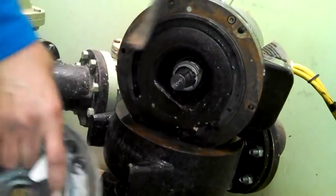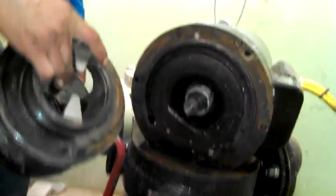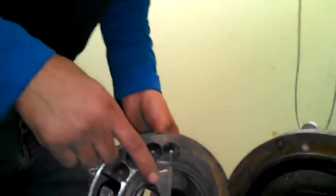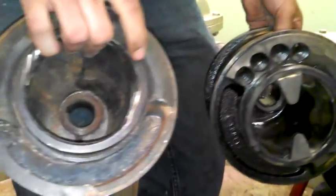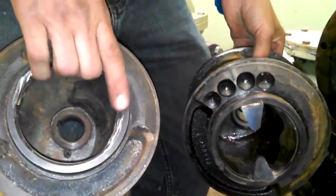So what we're doing today is pulling off the impeller so that we can put another impeller on. Here's the cutter blades, the teeth. Here's the other impeller which we already removed the cutter blades from. Because we've been getting rags cut up on the cutter blades, we decided to remove them on this impeller.